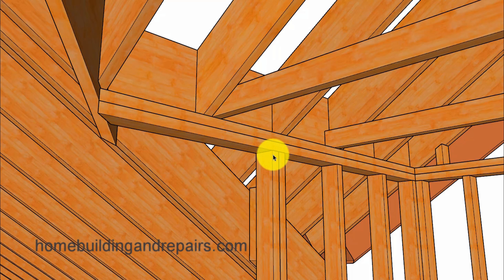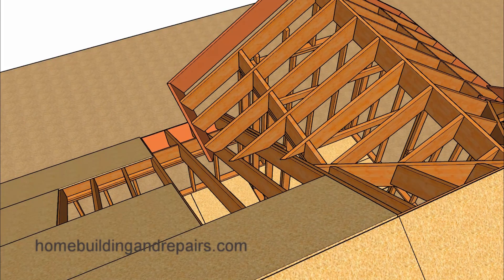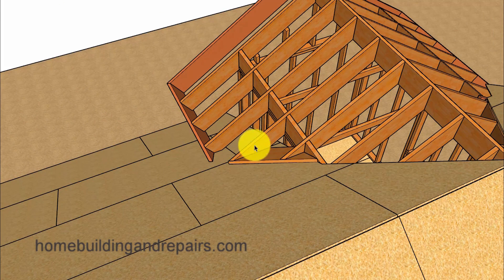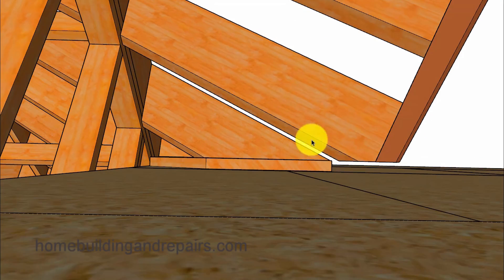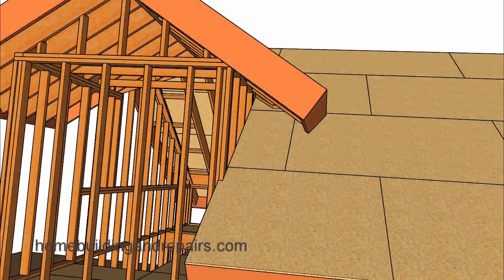However, I didn't do that in this design because I didn't want to extend the wall into the storage area any further. Next up, let's head back to the top to see how the roof sheathing and the sleeper board or backing board is going to work out. Even though these two rafters will be sitting on top of this backing board, it's always a good idea to leave enough room so you can slide shingles or roofing materials underneath this section. For those hiring a roofer, it wouldn't be a bad idea to have them come out and look at this area to make sure it's built correctly. You can see we have a gap here, and we'll have the same thing on the other side.